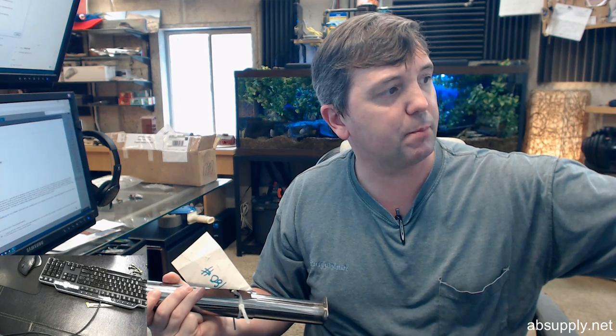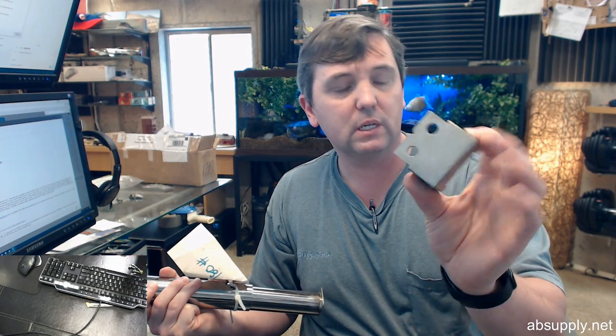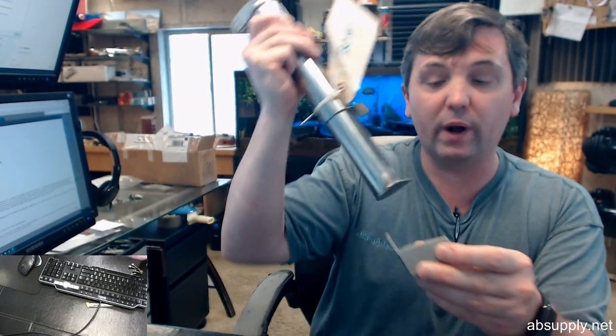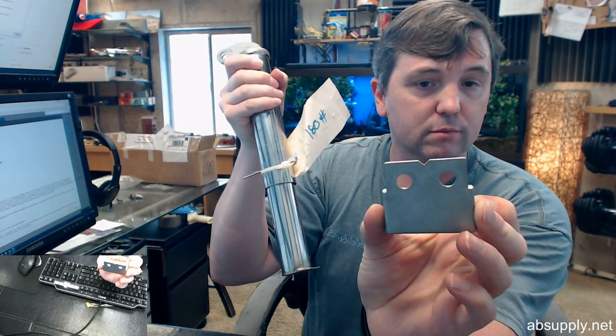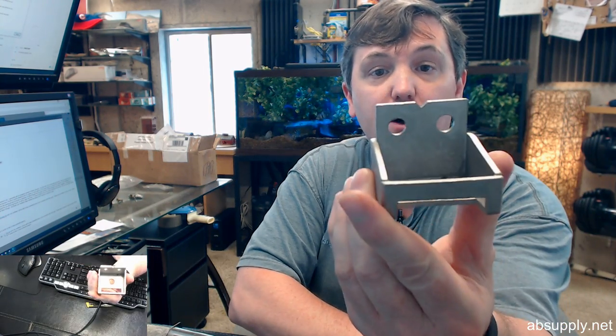It's not ferrous based because it's not magnetic, so you're going to want to bolt this to the sidewall. Don't attempt to weld this. Many people will just weld these on. This is not going to be suitable for that. So your installation will look like that. You're going to have your two bolts. Oh, forgive me. You'll get bolts for those brackets, the top lid brackets. You'll get a total of 4. Then you're going to get the 2 bolts to hold the boot down.